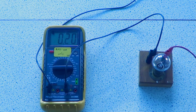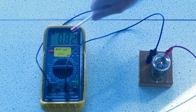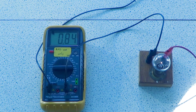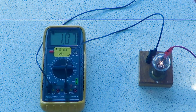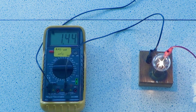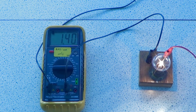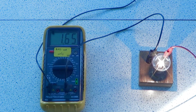Now if I turn that up slightly, you can just about see the bulb starting to glow. We're on 4 volts and we've got about 0.82. I'm increasing the potential difference again, it's getting a little bit brighter and we're on 1.06. Turning up to 9 volts, that's giving us 1.43. And there we're up to 12 volts - nice and bright - and we've got 1.66.